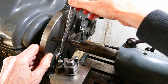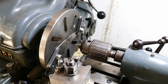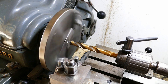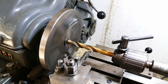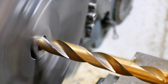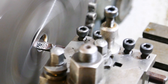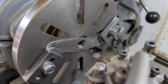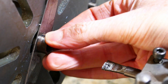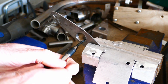I've attached the first part on the lathe faceplate so that I can bore out the central hole to the right size. I start with the drill, and then move on to a boring bar and bring the hole to the finished size. I've used an off-cut of the tube as a test piece to check the fit. Using my deburring tool to clean up the holes.